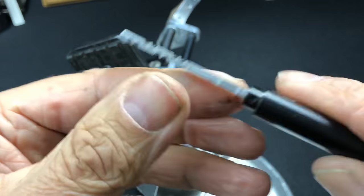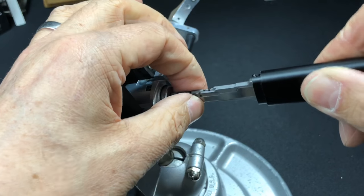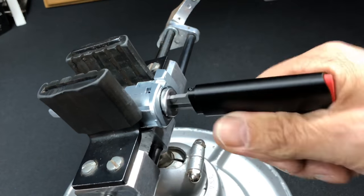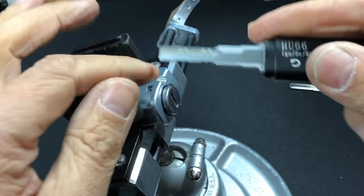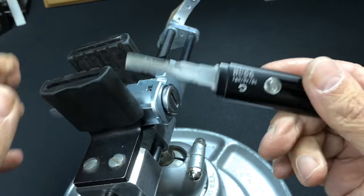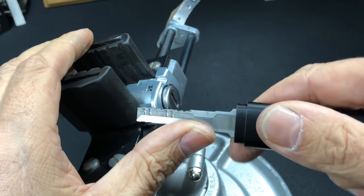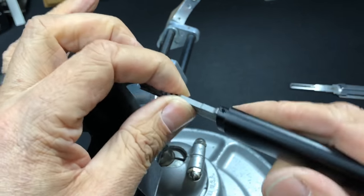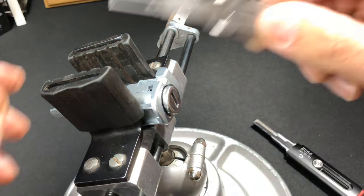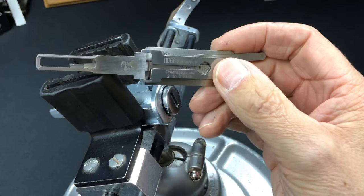We could have a duplicate key made from here. Just to prove it again — put the decoder back in, retract, and there you go, absolutely perfect again. It's a very effective tool, one of my favorite lock tools — the HU66 quick decoder, a wonderful tool. As long as you follow those steps: make sure all the wafers are zeroed, make sure you've got the correct orientation, then left and right rotational motion up and down against the tool — definitely not side to side, because it'll just snap. Both the HU66 Lishi and the HU66 quick decoder are very very good and effective tools. Hope you enjoyed it — I'll be back with another lock very shortly.